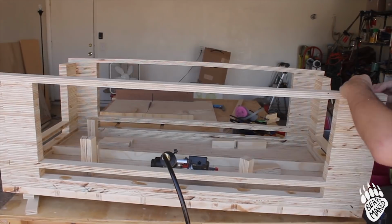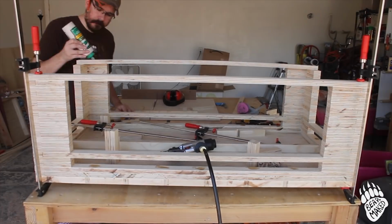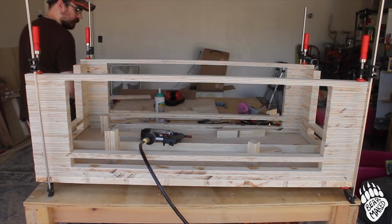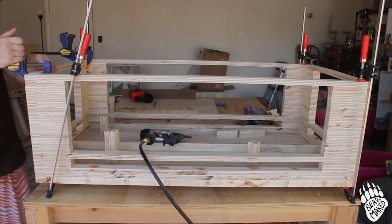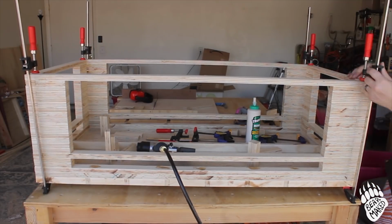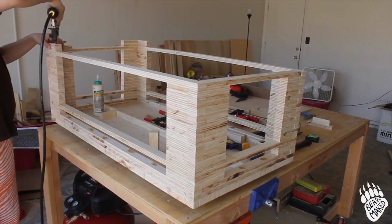And you can see I'm just measuring and cutting these long pieces to fit on there. And this is where I got to work with that bow a little bit and make sure I clamp down the ends so that they stay put. Again, this is just reinforcement to make sure those legs don't want to splay out near the floor. If somebody puts lateral pressure on the table, you want to make sure they stay nice and rigid.